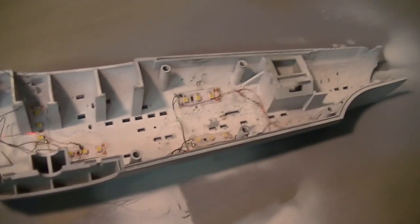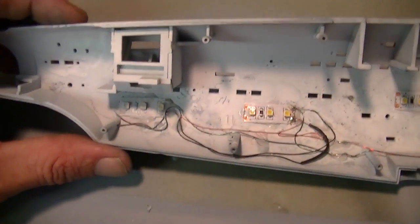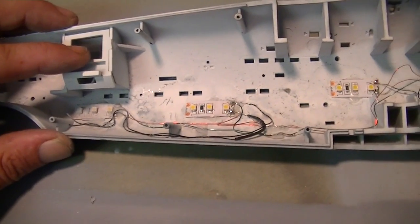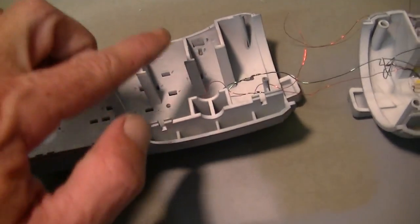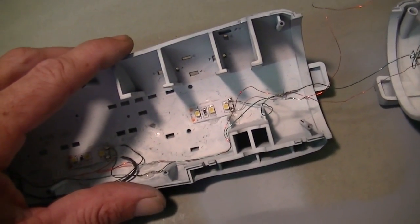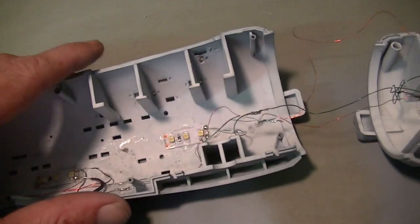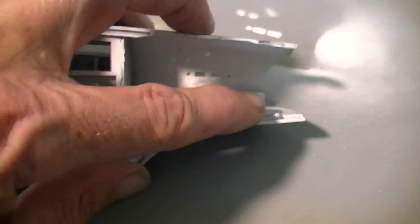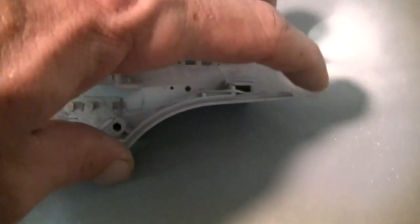Over here at the spray booth area, I've got some more painting work done on the secondary hull and I'm getting ready to spray the outside now. I've got a couple more wires to install for power that we need to get up to the nacelles for the Bussard collector power, and some that come out the bottom to our base and some that go out the top through the neck to light the neck and power the board mounted in the saucer for our saucer lighting and navigation lights. I've also got to install the LEDs for the ion pods — the little ones that flash at the rear — and I've got an SMD mounted on the bottom underneath the shuttle bay to light up the little lights on the fan tail.